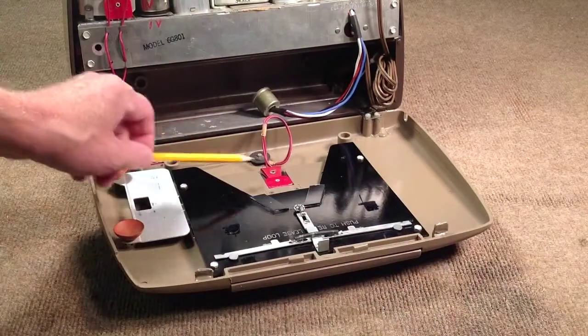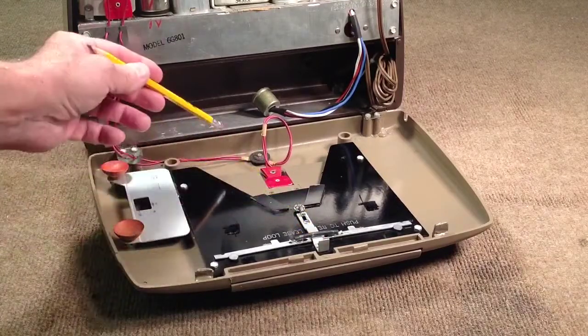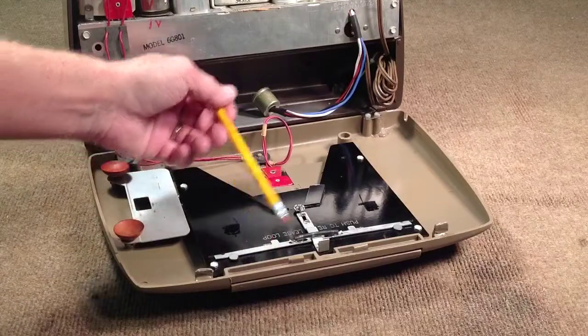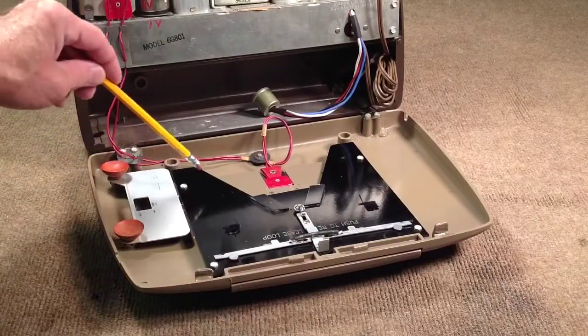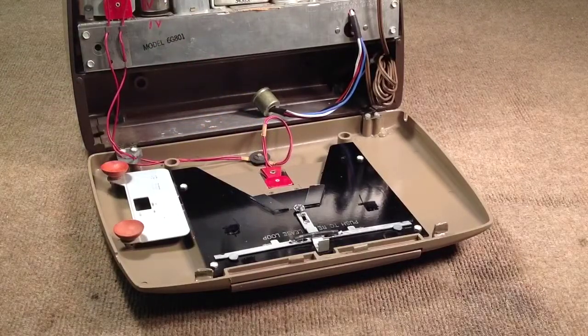When this little cam is pushed, the wave magnet is going to fly up out of its holder. It's actually designed so you can also release the wave magnet entirely, take it out of the cabinet, attach these suction cups to it, and put it on a window if you were traveling in a bus, train, or a steel building to improve your reception. Very similar to an arrangement you see in the Transoceanics as well.